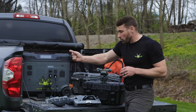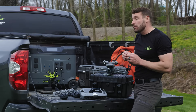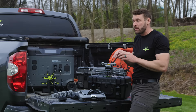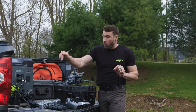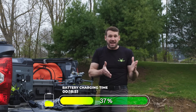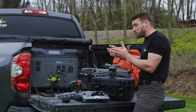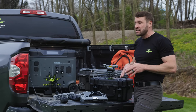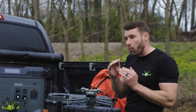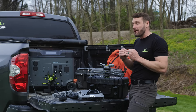Talking about charge time: when you have it set to 90% using a 100-watt charger with only one outlet, it will charge your battery from 13–15% up to 90% in almost exactly 50 minutes. The 100-watt charger has two outlets, but when you split it, it doesn't have as much power going into the flight battery. So we only use one USB-C to C cable going into the battery hub. Each battery — if you put three on at the same time — will be full in 50 minutes. If you tell it to go to 100%, you're looking closer to that one-hour mark. When I'm out in the field I have it go to 90% so I get a faster charge.